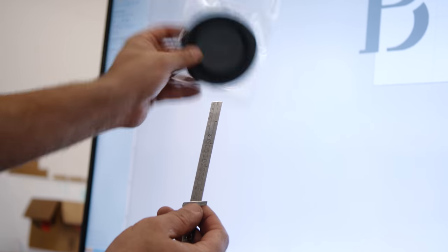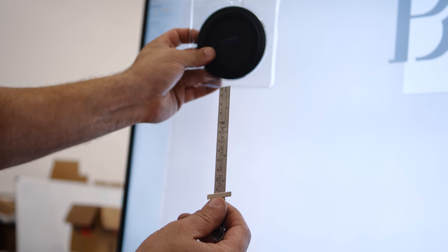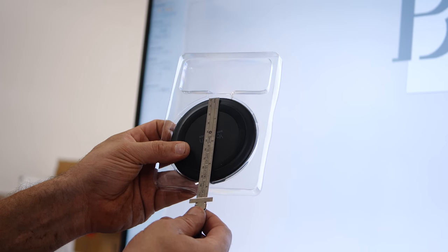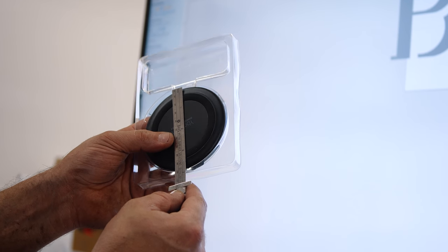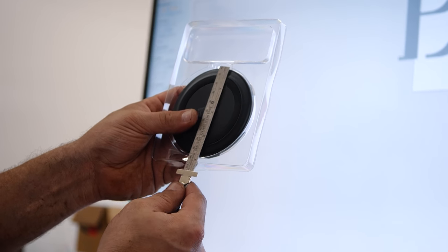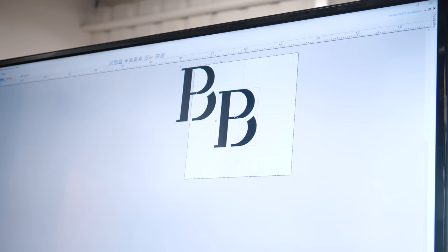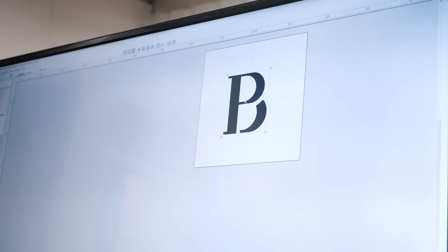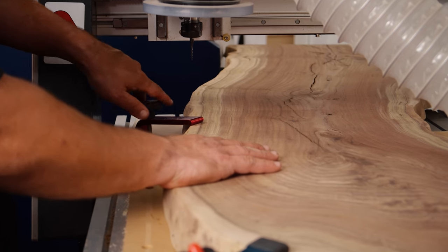Here's my wireless charger, and there is his logo. I think it would be nice to have his logo be the same size as the wireless charger so you know exactly where to put your phone. This is about three and five-eighths tall — that's how tall we're going to make his logo in V-Carve. I would usually use Fusion for everything but engraving. V-Carve, when it comes to engraving, is really just the best. So we're going to head over to the CNC and go ahead and put this in the slab.